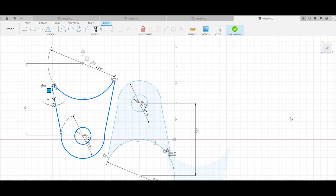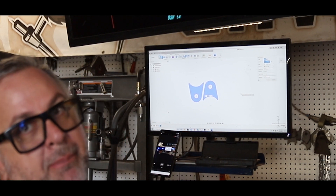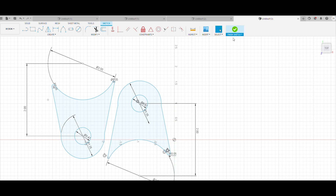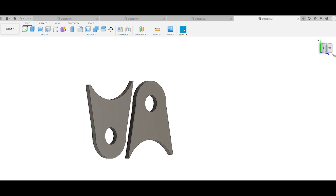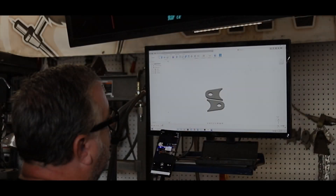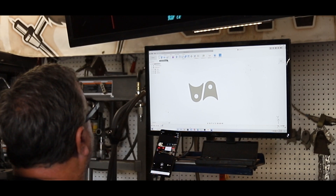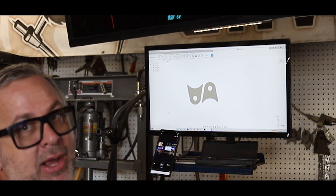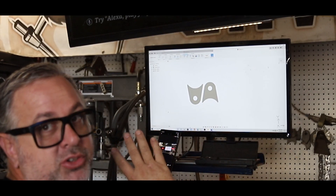I go up here to finish sketch. While on this screen, I highlight both shapes, right click, and extrude them. You're going to have to figure out the speeds on your plasma cutter. I know what mine are for the most common materials I use, which are eighth inch and three sixteenths. So this is eighth of an inch — .125 plate. Now you can see I have a tab in multi-dimensions. I go back to the orientation I want, then from this screen I go to Design, then Manufacture. When you get to the manufacturing part, the first thing you want to do is change it to standard measurements — where it says mm for millimeters, I change that to inches and hit OK. That sets it up for SAE.